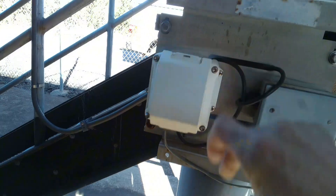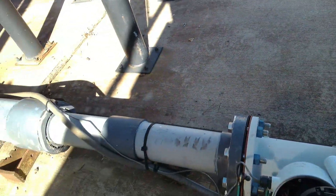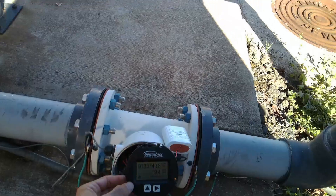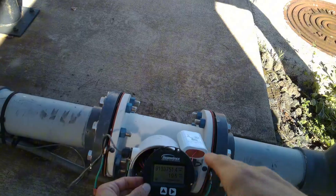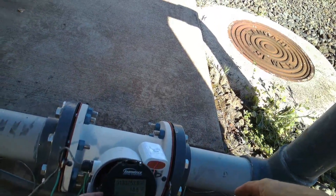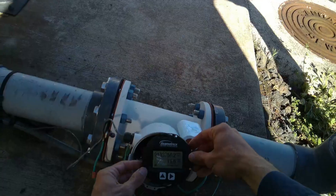That looks good — that's our remote register. The meter itself has a minimum flow. This is a four-inch at about six gallons. But even if it falls below that minimum flow threshold, the sensors on the inside should still be wet, and this would just display zero GPM if it was below its minimum measurable flow. It wouldn't show empty pipe. Empty pipe means the sensors aren't wet — or aren't connected.